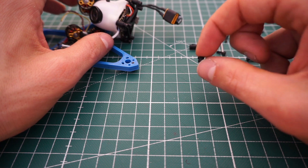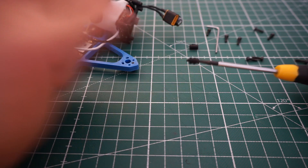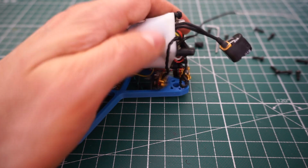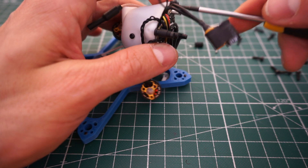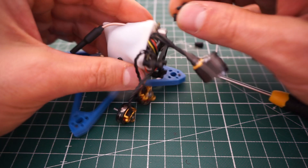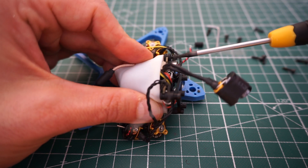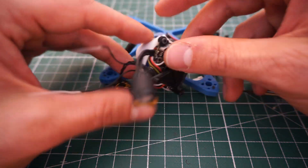One thing I forgot: there's a smaller rubber grommet from the Caddx mount hardware. For this you take one of the M2x7 screws, put it on there, and this goes on the rear part where you don't have a mount from the adapter — so you fix it here so that all four holes on the Crazy B are used. Insert the rubber part, insert the screw — now it looks good. Everything holds up well and is nicely protected inside.